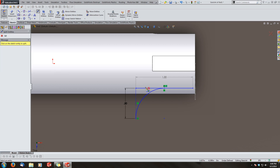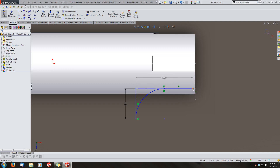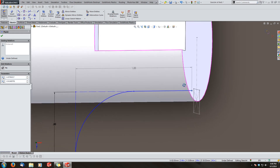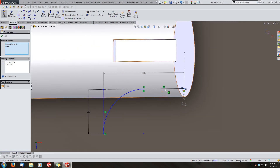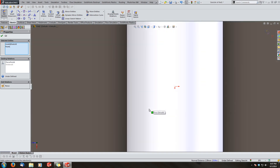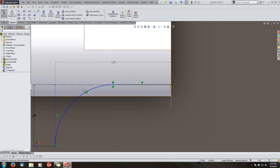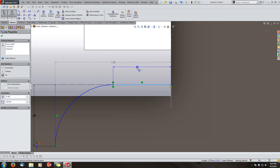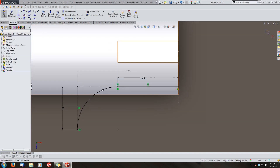Sorry for the distraction. I'll grab the line and break it right there, drag it back to the tangent point of the arc, then make that segment a construction line. Now I'll take this point, hold Ctrl and grab this segment, and say Pierce. That constrains the endpoint of this line to be planar to the other line, fixing it to a point. With the dimension driven, I can make the keyway length three-quarters of an inch.